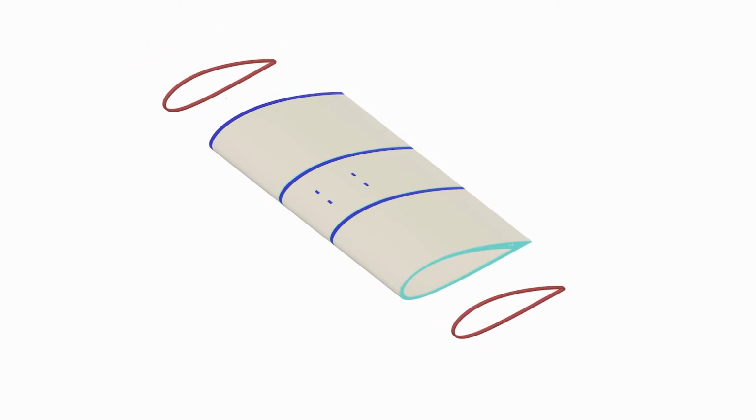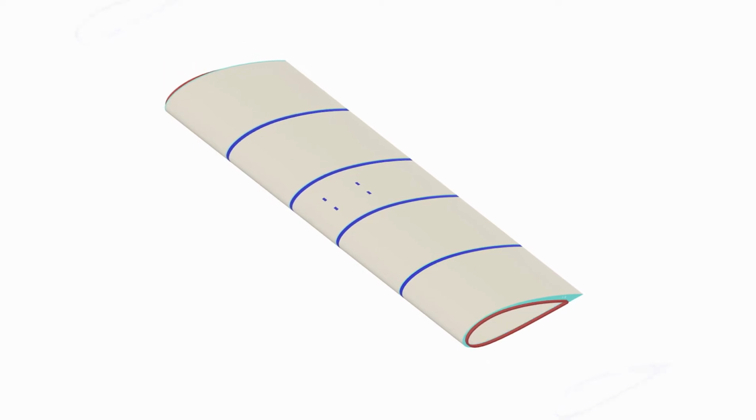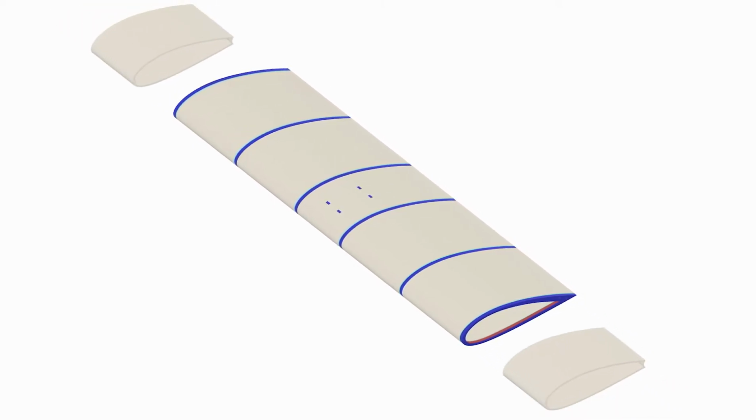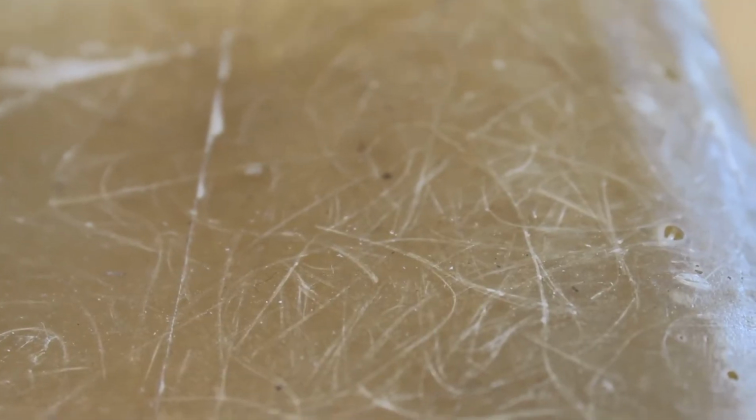The ribs in our wing come about every 200 millimeters, and each rib has a rib cap and a bearing surface. And the bearing surface is what the moving wing slides on. One of the unique aspects of this project was working with PVA, which is a water-soluble 3D print filament, and we were able to use that to create a male mold for the static wing to make the composite. The findings for the composite were looking at the different weaves of twill weave, unidirectional, multidirectional, from carbon fiber to fiberglass to overlaying both of them towards the end.